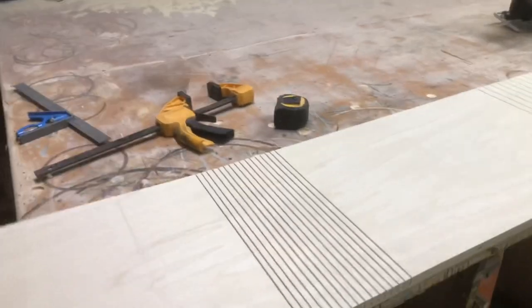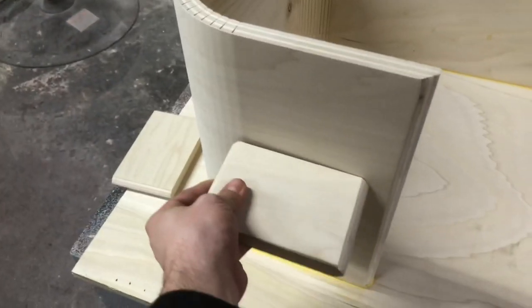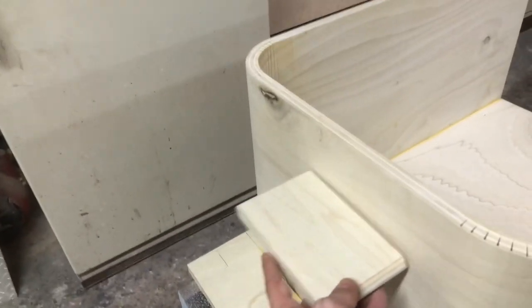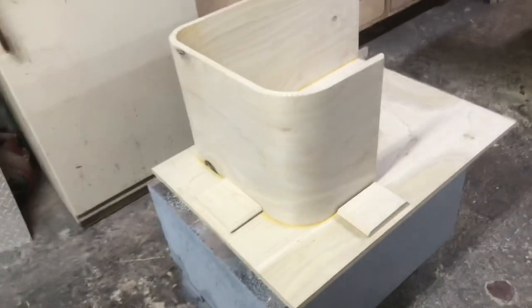Back kerf cut up. Got this piece, then this bigger one here. There we go. I'm getting some braces put in the port. I'm gonna have one here that's gonna brace the port to the back wall, and then one here as well that'll brace the port to the sidewall. So it should make the enclosure a lot stronger adding those braces in. I'm gonna start getting these glued up and let this thing dry while I do the braces.